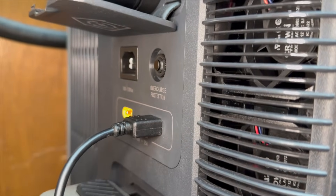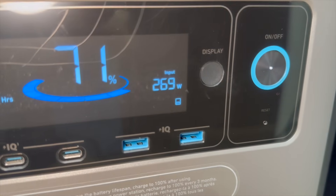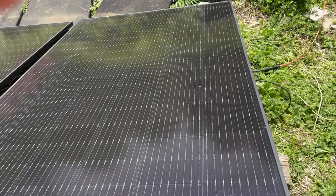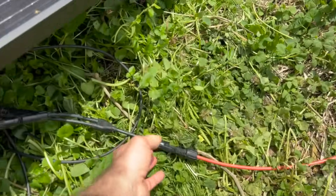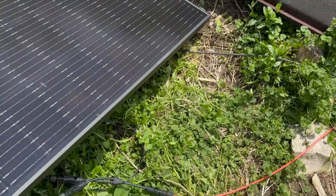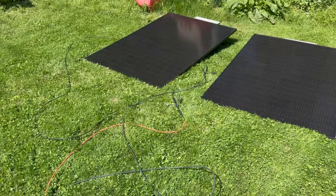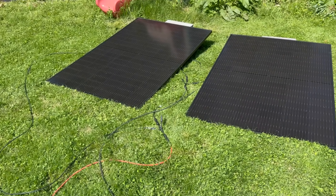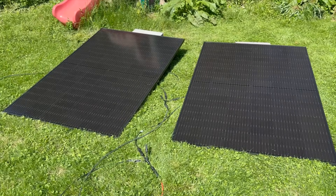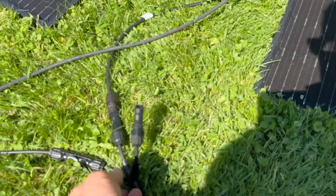Here I have solar panels hooked up inputting about 270 watts. Each F3800 can input a total of 2,400 watts of solar directly, but to achieve that you'll need to parallel panels because of the 60-volt input limit. You can use any brand of solar panels as long as the input on each port stays under 60 volts. If you have this setup at your house, you could consider the Anker 405-watt solar panels — I have a total of 810 watts of solar here, but I have to parallel them to stay under 60 volts.